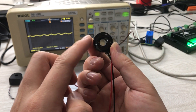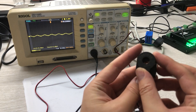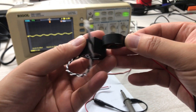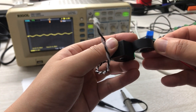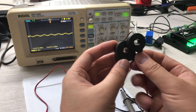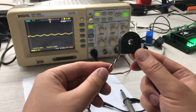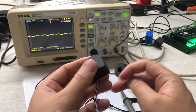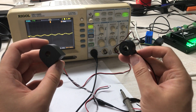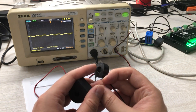You can choose the blue one or the anti-DC one — those will reduce the DC signal interference and give a good signal. But in most cases, this small CT sensor is no problem — it's also a good CT sensor because it's very small, about half the size, saving space in the power distribution box. However, if one or some channels have incorrect data, you can replace it with the blue one or the anti-DC one. This is how to choose a CT sensor and how to solve the issue of incorrect data. Thanks for watching.